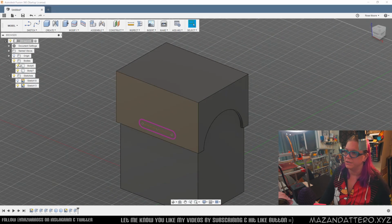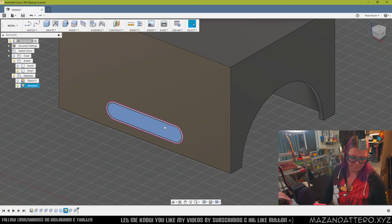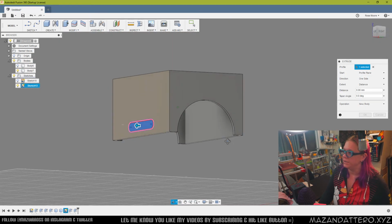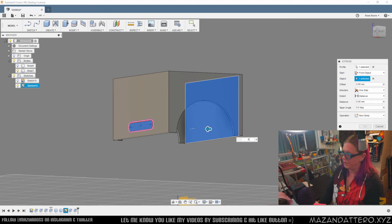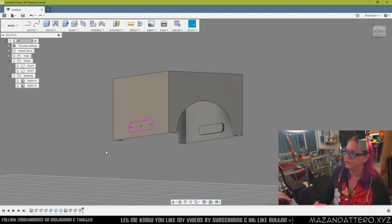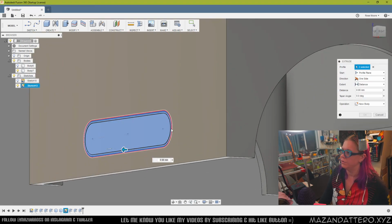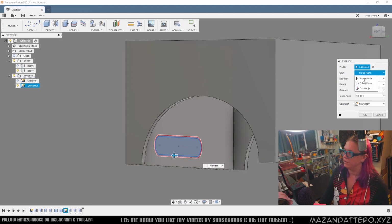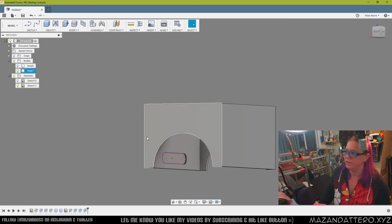So you're going to do this exact same thing reverse to the lid. So you're going to create a nub from the inside of this back side here, from object, face, 0.8, join. And then you're going to do this similar thing, but it's the insert for the opposite side of this. So from object, inside of this space, do a 0.7. It's going to cut, say okay.